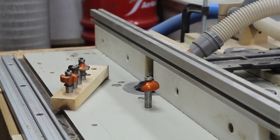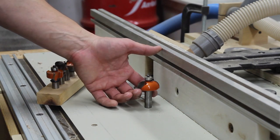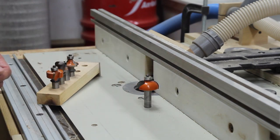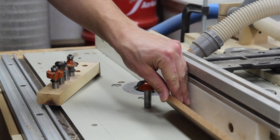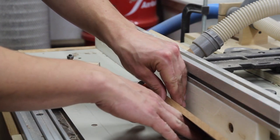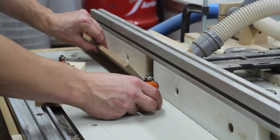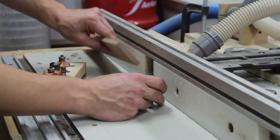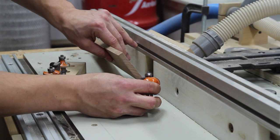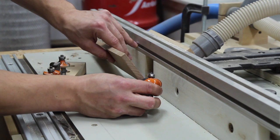One of the trickiest things in this project was getting the barrels to fit on a one inch dowel. What I ended up doing on the router table is using a cove bit and building a 45-degree table, so I had the board supported with another board at 45 degrees. That allowed me to run it through at 45 with the bit adjusted just right, and cut that nice cove in the end — and it ended up fitting on the one inch walnut dowel just perfectly.